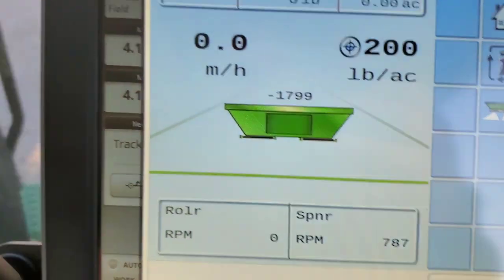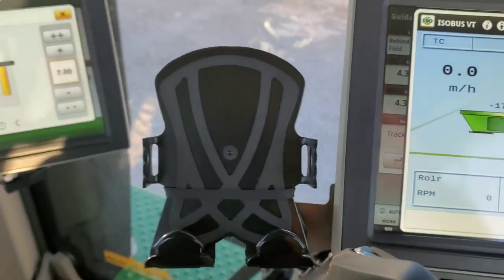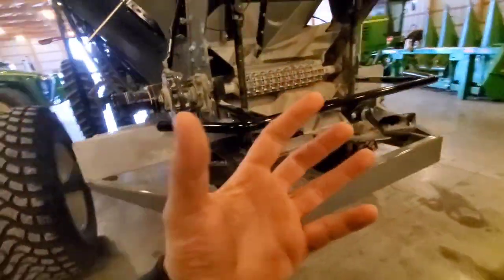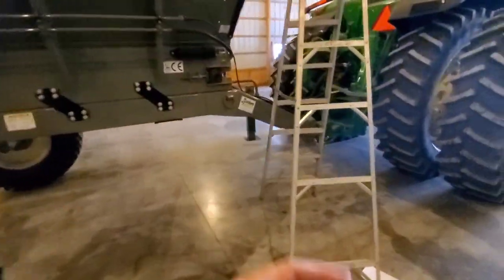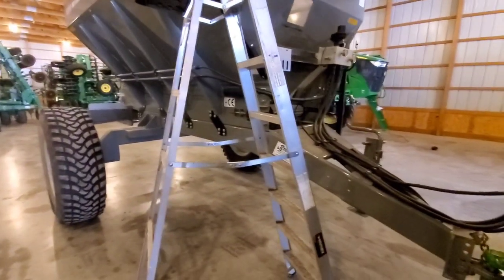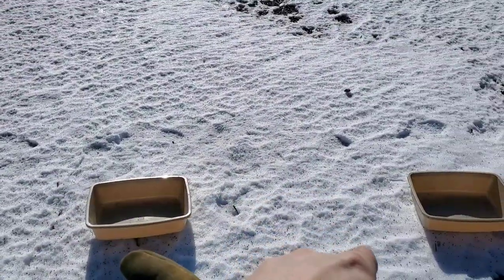It does have spinner speed readouts, running on SCV number two so you can dial it up or down. This is the extended monitor. With ISO bus setup, we can control rates on the go and do prescriptions — very quick and easy to change. There are other options available on this cart, including PTO driving a hydraulic pump or a direct PTO shaft to the rear with a contact wheel to run the chain. We felt this hydraulic configuration was the best — it does require good SCV flow, but it eliminates a lot of driveline problems and is the best bang for your buck.